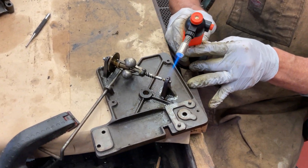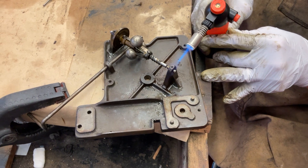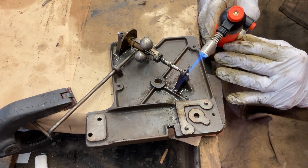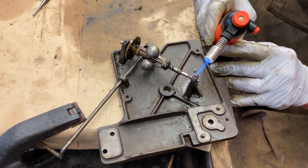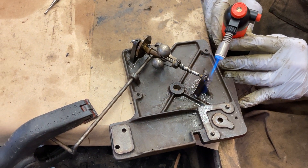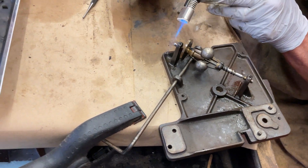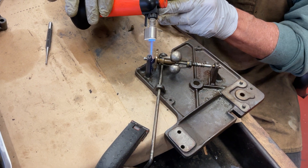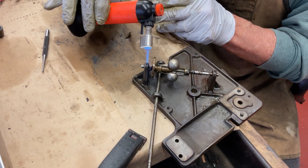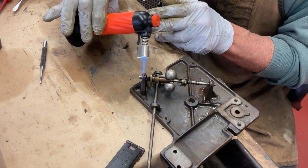It's so much fun to play with fire. I'm heating the casting and the bearing right here - just the bearing. And that's to melt the varnished oil - melt the varnished oil, just a little bit. You do want to turn this torch off before you use WD-40, because WD-40 will ignite.